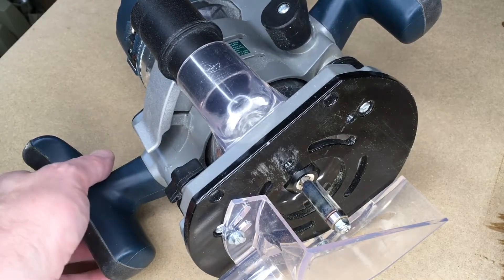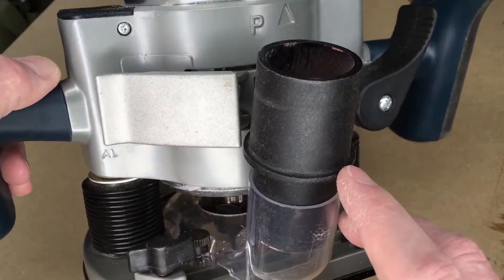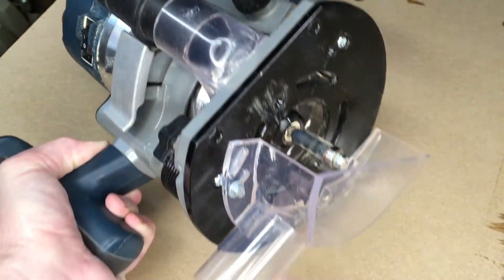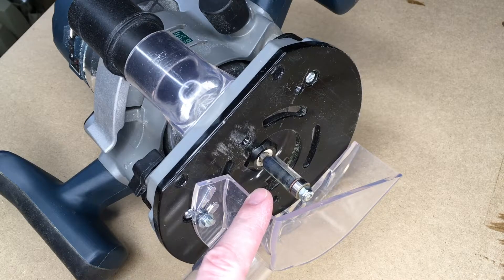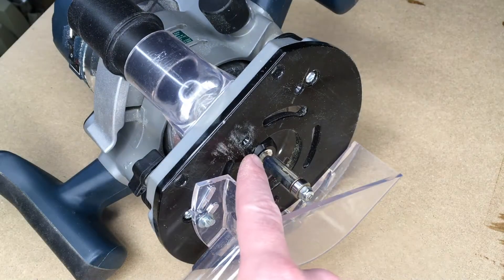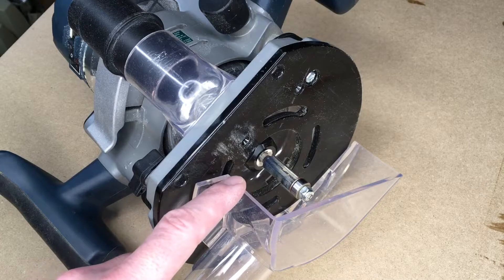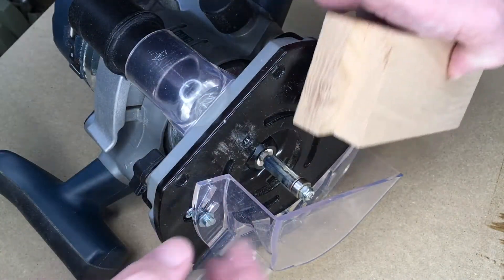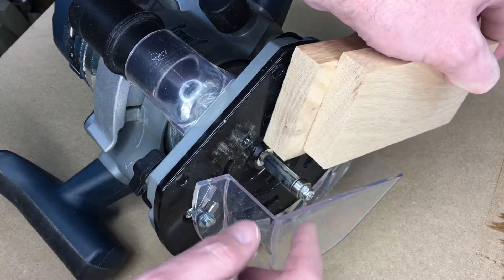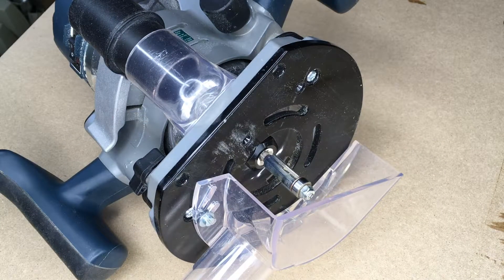I'm about ready to start routing. I have a Bosch plunge router with a dust collection kit — it does top dust collection and I have an adapter for my small shop vac plus my larger one below. The shroud is documented for the fixed base router, but I got it to fit on the plunge router and it seems like it's going to work. It's a quarter-inch shaft, one-inch bit with a pilot bearing. It'll fling dust forward, so I want to keep it butted up against the wood while cutting. The way this is set up, it will cut the top layer down to be flush with the bottom. I need to focus while routing so I'll pan out and get started.